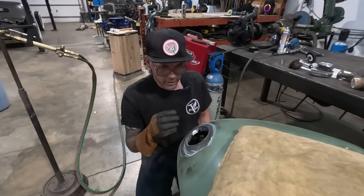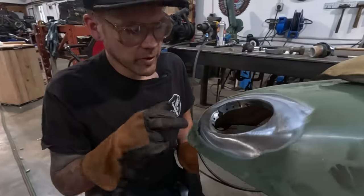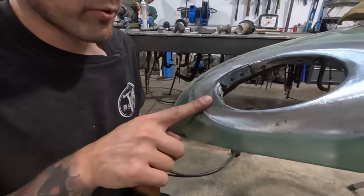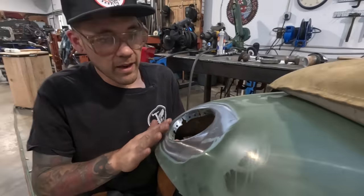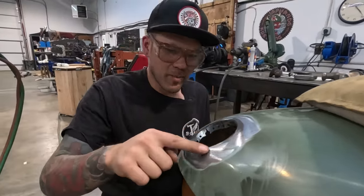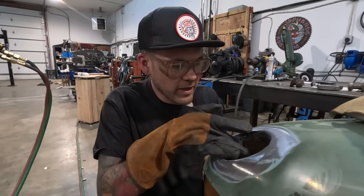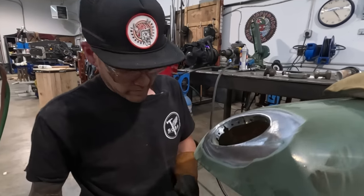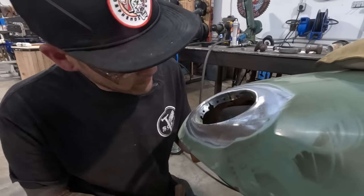Okay, now we can better see what has misshapen a little bit. I noticed that I've got a bit of a line here. There's almost like a crease. Maybe I was holding the dolly a little bit weird, but we're gonna have to hammer and dolly that a little bit. Just a couple of little areas. It really isn't that bad, but I'm still working this flange down from heating it. And it's getting there. Same as the other side, it's gonna get there.